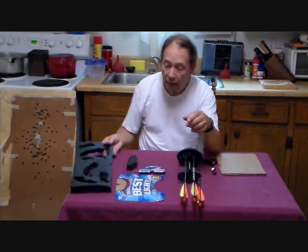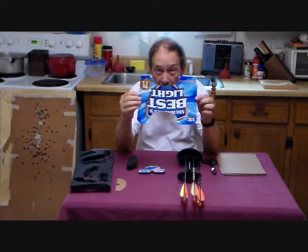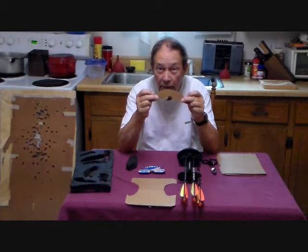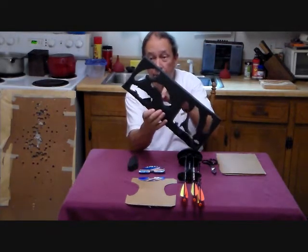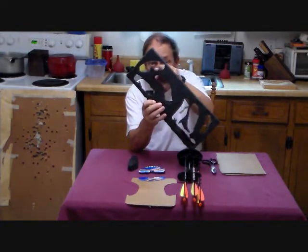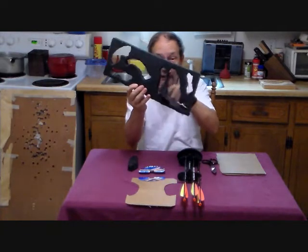What to do? Well, the idea is you take a piece of inexpensive material — cardboard, for example, out of this beer box — and you cut your shape out of it. You cut it to get it to fit. And then you take your template and you put it over your work, take a thin sharp knife, and you cut around it, like this. The result is you have a much smoother and better fit than any of this ragged stuff here.